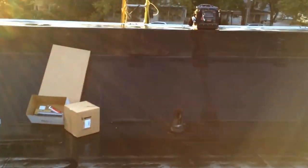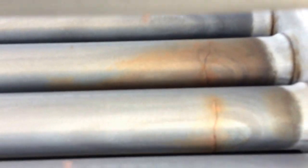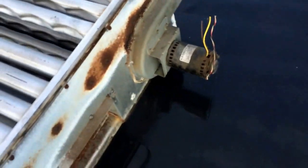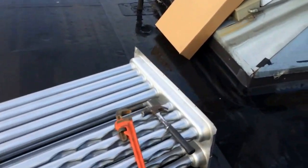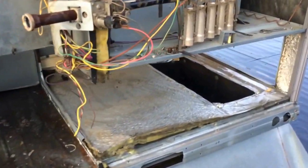Well actually the hard part is done — changing the heat exchanger is easy. There's our old one out. See those cracks right there? Crack and crack, nice and rusty. There's the new one — got a little bit of damage on it, so fix that a little bit. There it is with the old one out.